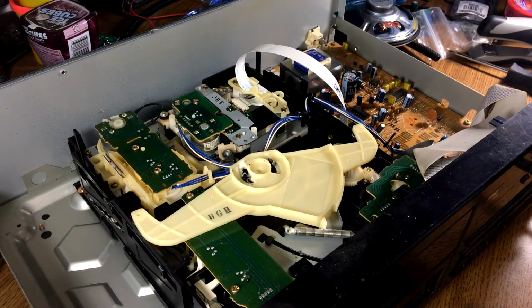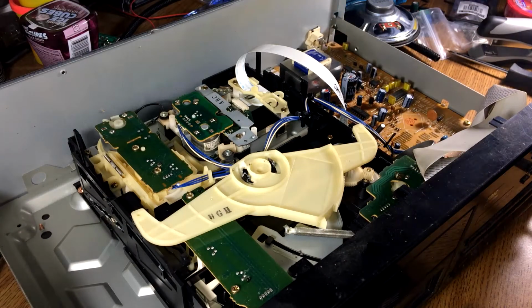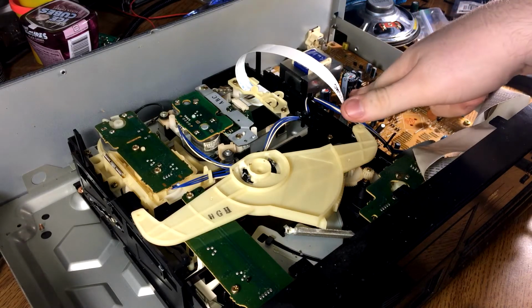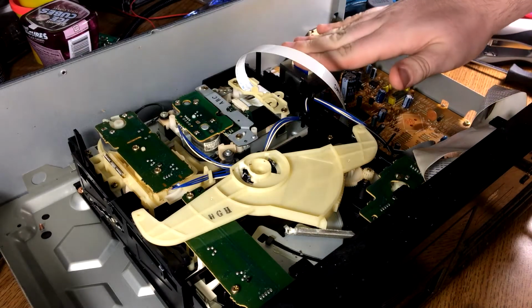So we're going to unplug this so it can discharge overnight. Actually, I was wrong. This and the other Pioneer are linear supplies. Because that is a bridge rectifier. And this is a bulk Nippon Chemicon filter cap. That is not a switching transformer. That's a normal iron I-core, I believe.